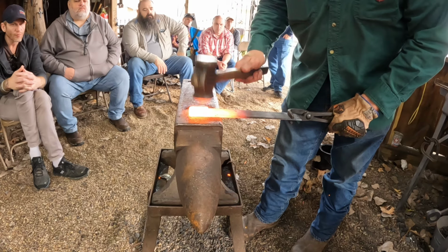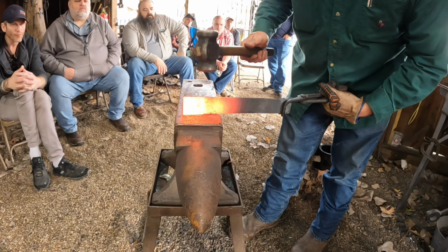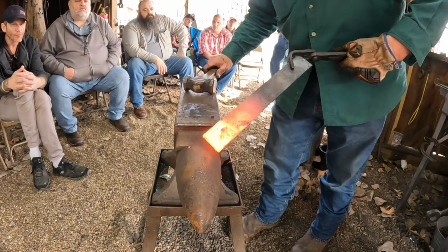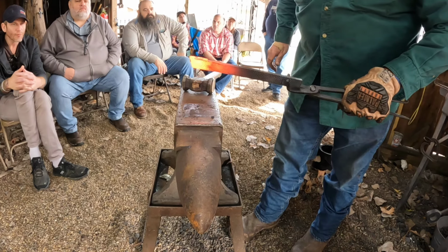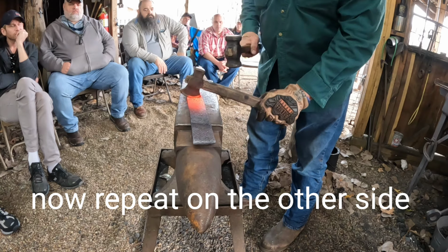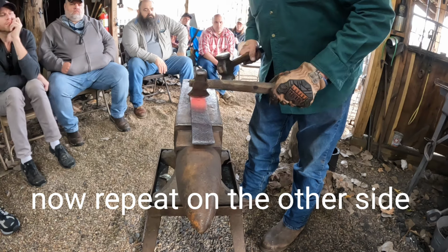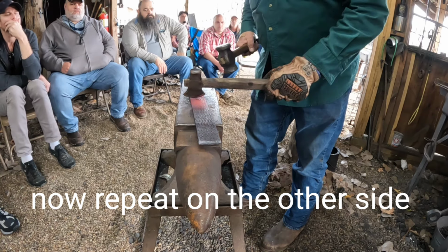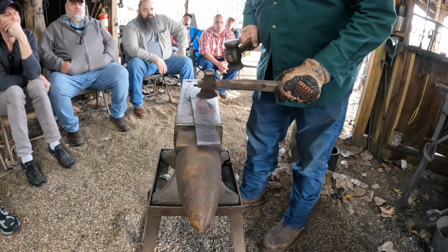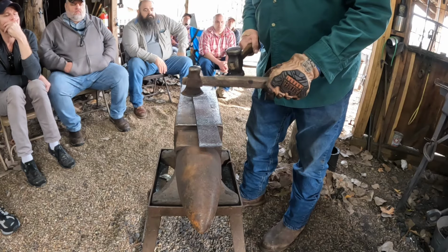Notice I went back on my handle because the heat from that thing was eating my knuckles up. Alright. That's it, we're forge welding. Find where I started. Much better. I'm not trying to cut it off. Just want it to bend. Cut halfway through? About 2/3, 3/4. If you go much more than 3/4, it'll probably break.